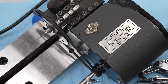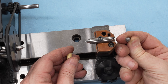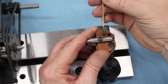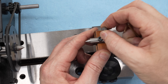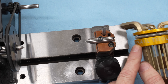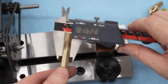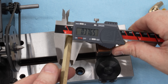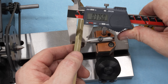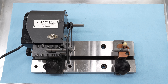The tail stock has a hole to mount a wheel dresser for convenience while grinding. This is a quarter-inch diameter dresser I picked up on McMaster-Carr for a few bucks, mounted with a set screw. I noticed the wrench isn't quite fitting into that set screw. Jason, if you're watching — I love the Allen wrench holder, but these Bondhus wrenches that come with it are oversized. This one is a 3/8-inch and measures about 0.376 — it really should be under 0.375 to fit properly in a fastener. These are just endlessly frustrating because about half the time I can't get them into the screws at all.